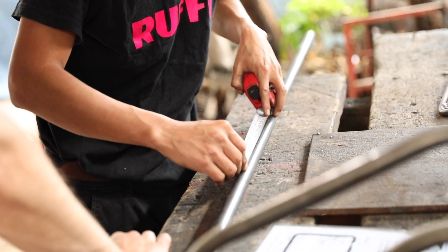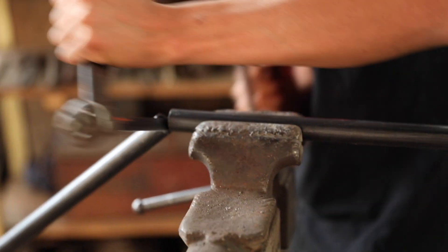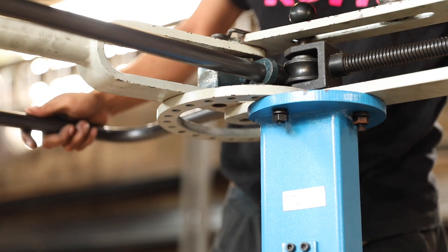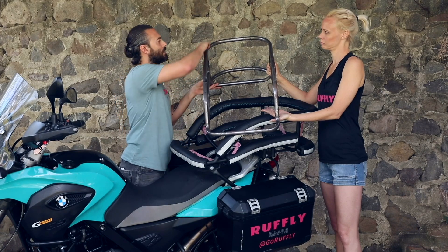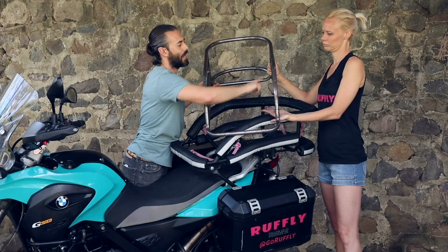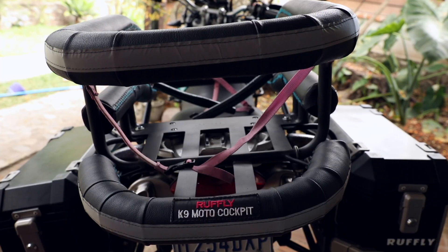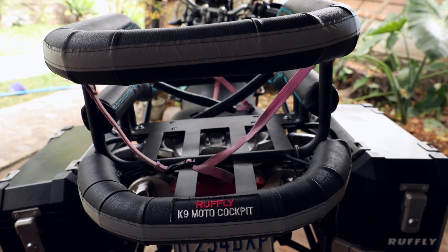The cockpit's tubular frame is made of three-quarter inch tubes or pipes. We cold bend and weld them together, and they start with four pieces: the top piece that goes around the top, comes back and connects to the bottom piece in the rear, and then a vertical crosswise component as well.